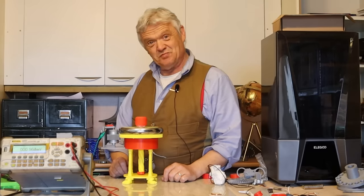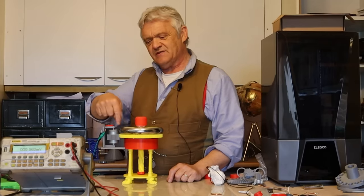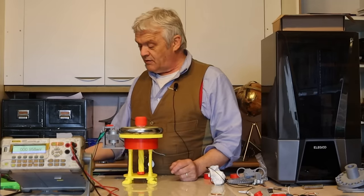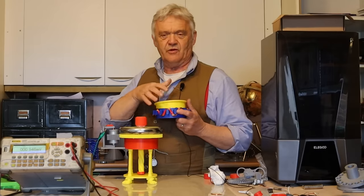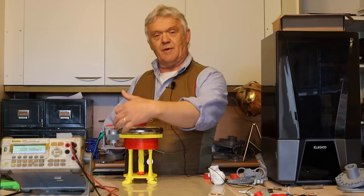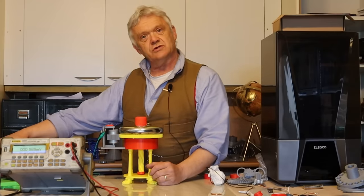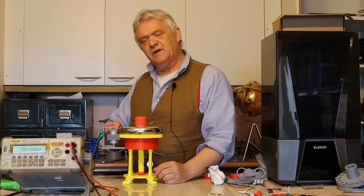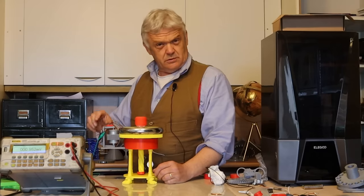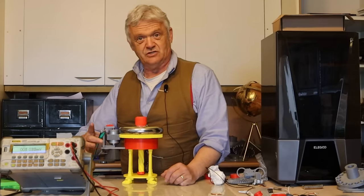We got 3 to 4 volts out of it, which is pretty good — it was so easy to push. I might actually put another gear set in between, because it was really easy to work. If you remember, with the magnet and serpentine coil arrangement we got about 6 or 7 volts. It's no real surprise because this one is using ferrite magnets, which are not particularly strong, whereas that one uses neodymium magnets so the magnetic field is very much stronger. But this has the benefit of being everywhere — it's an easy adaptation that would work on absolutely any motor, so you don't need to wind serpentine coils or buy neodymium magnets.